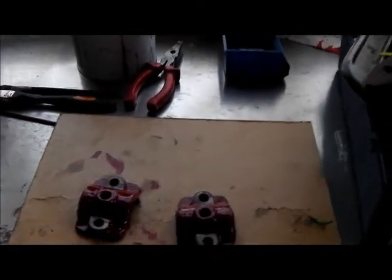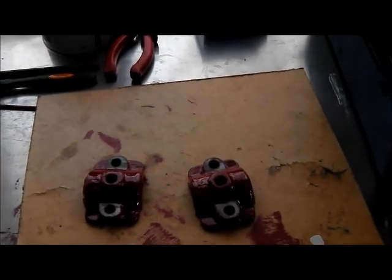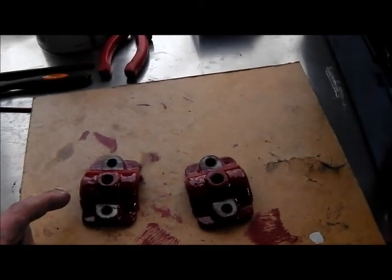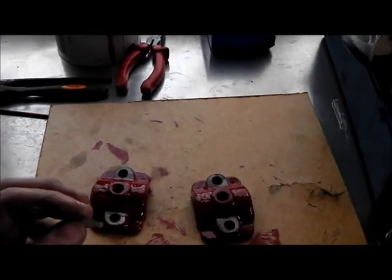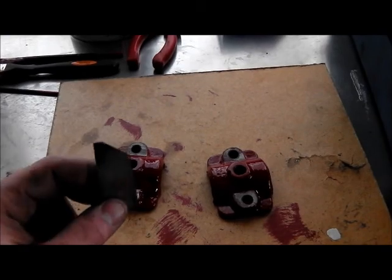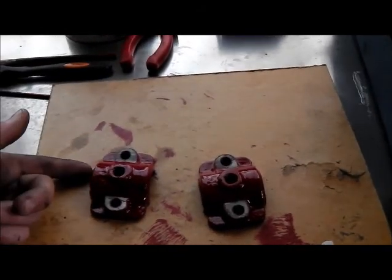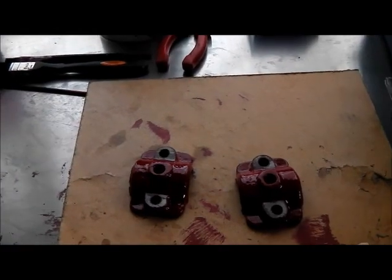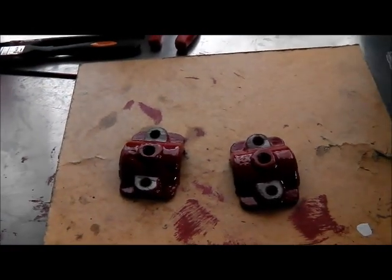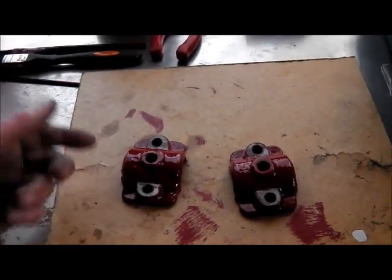Hi all. I've been doing a bit of work on the old Ideal engine. These are bearing caps and I'm just making some shims at the moment. I mentioned in my video about the bearings that I'm going to have to make much thicker shims — these are way too thin to make the hole where the bearings are going to go round. So I've got to pack it out a bit and increase the height, then they'll fit okay.